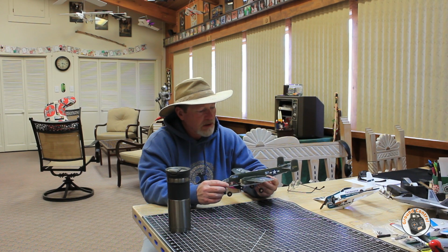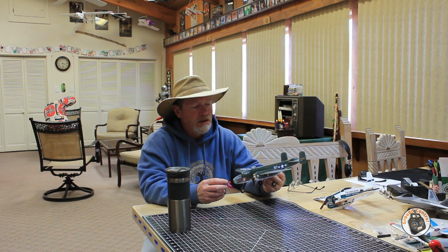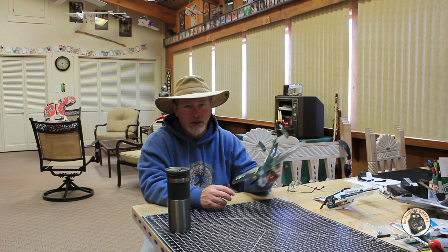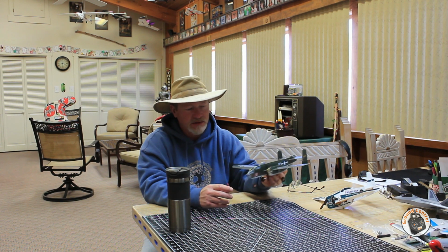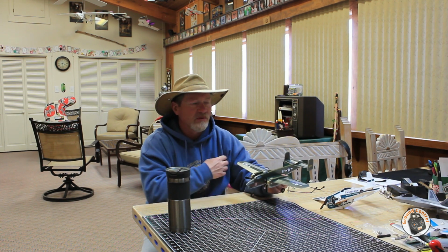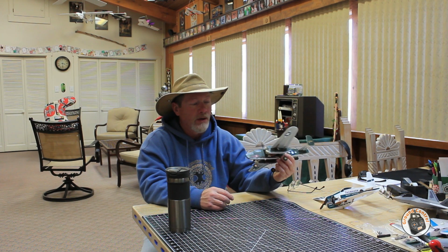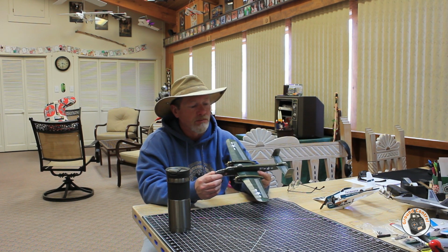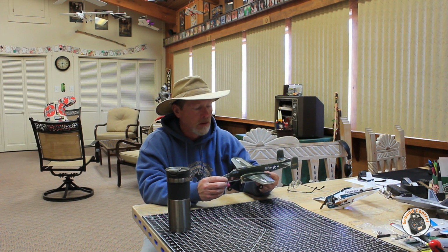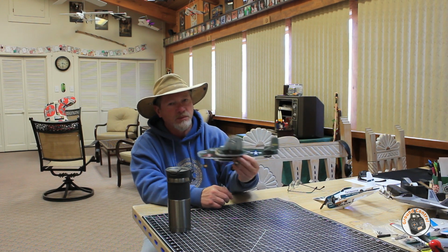It was kind of squirrely on the third launch. I should have known better than to put much aileron into it with it being tail heavy, because that just exacerbates the problem. If you saw the second half of the flight on the third take, it was flying around pretty smooth, because I was making sure that my turns were a lot more shallow, being that it was tail heavy, and then it was pretty darn smooth.